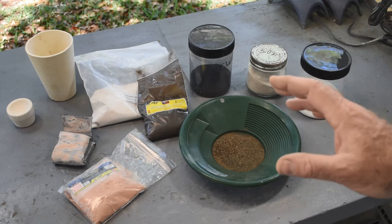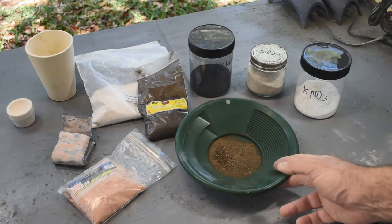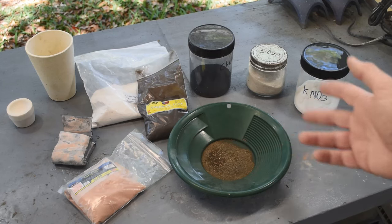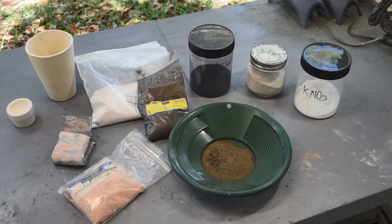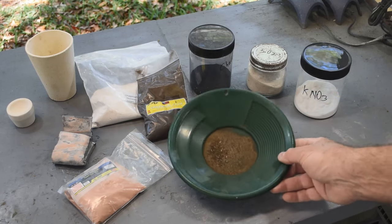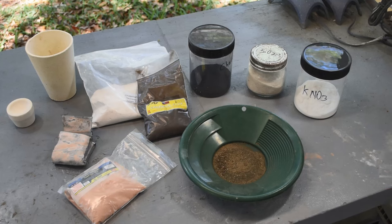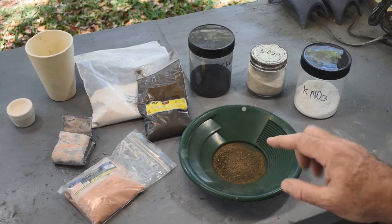I'm going to try and keep this simple because I'm not going to do this the way Jason's doing it. Jason tries to reduce the sulfides, get them absorbed in the slag, release the gold they contain, and get the gold collected in a button of collector metal. There are a lot of moving parts there that all have to work just right, and if you watch Jason's last smelting video, he's having some trouble getting his recipe right too.